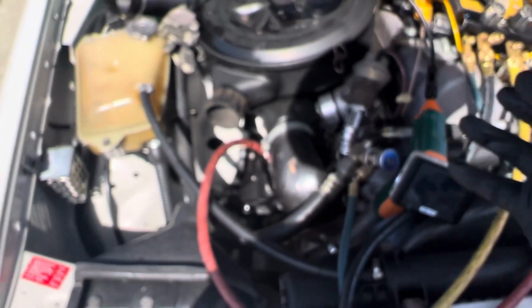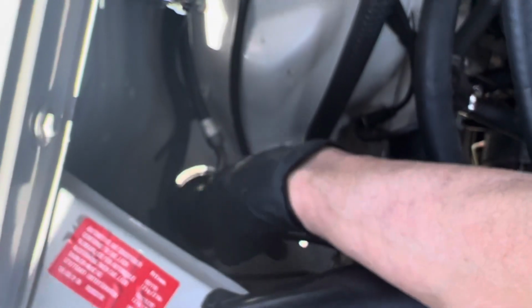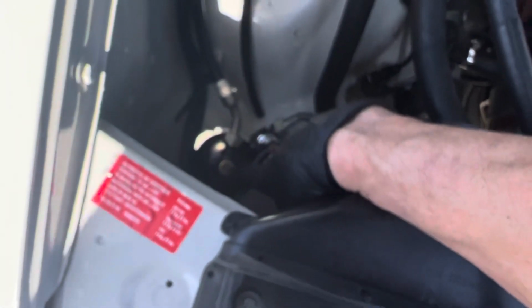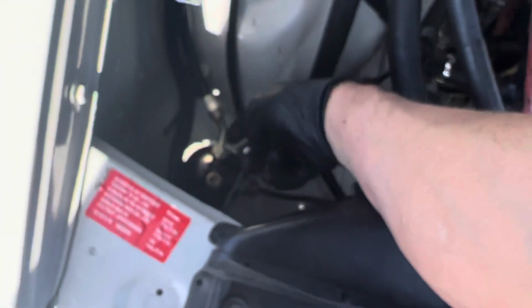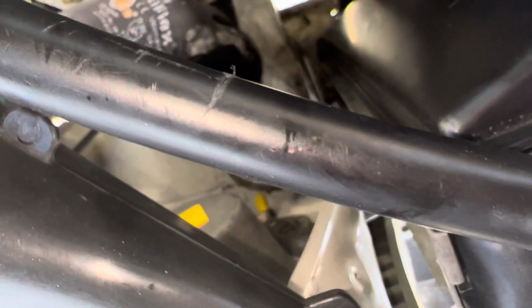Okay, that's rust and moisture damage. That's from moisture in the system, turning the refrigerant acidic and causing rust. These are steel lines, and if you contaminate them with moisture, they rust. And if it rusts past the bottom of the receiver dryer, that will rust too, and particulate matter from the bottom will come up the straw from the bottom of the receiver. Then these lines will rust on the inside and the flakes will come off, and then it's on the liquid line and it'll plug up an expansion valve, caused by moisture, and especially when you have air in the system.